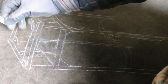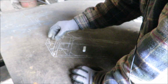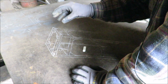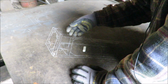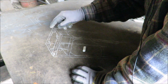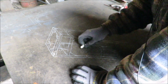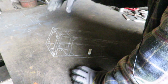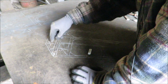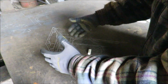So, we'll get on the lathe, we'll tap some studding, because the nice thing about using threaded bar is we can epoxy that into the woodwork, and it's not going to come out. It's not going to just slide back out again. So we'll put an internal thread on a bit of threaded bar. We'll do that on the lathe. Then you can put the block on a worktop without thread sticking out underneath, and you're not going to drop it in there and crunch your threads on the metalwork. So when it comes to fixing it, stick it on the frame.